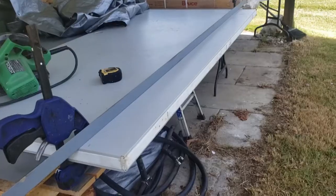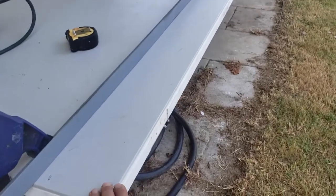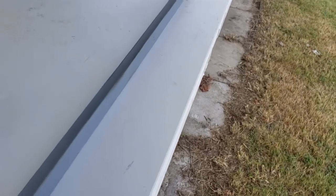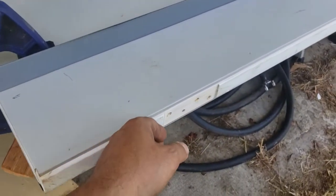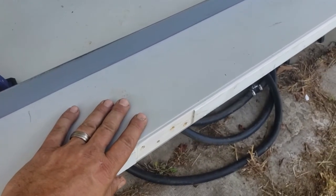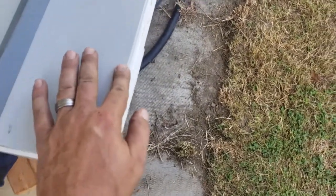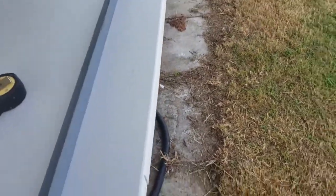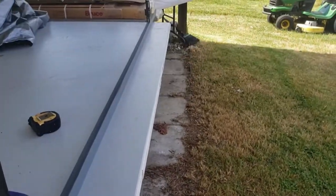Frustration. Okay, so at this point I'm going to shave. I've taken the hinges off. I'm going to shave some of this width off the door, and then most likely smear it with the Sikaflex to fill any of the wood, and put a coat of paint on it. After that, I'll be putting a piano hinge on the outside. So a little bit of a kludge, but I'm not going for glamour here. I'm going for functionality on this bus.